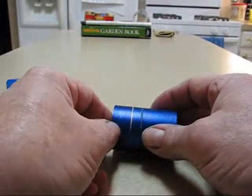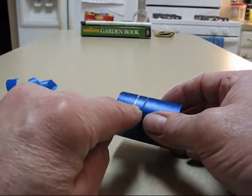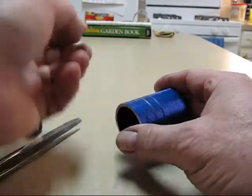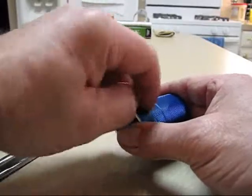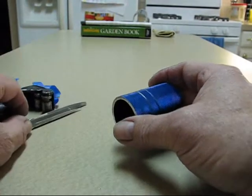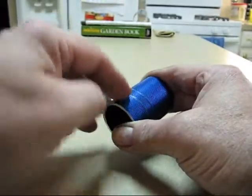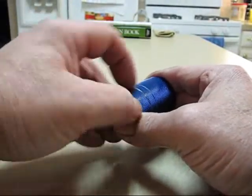You can hopefully see that we've got a nice ring cut in there. Then I'll take some 600 or 800 grit sandpaper, fold it over, and just take it and rub it in the channel to smooth it off a little bit. I'll also take some four-aught steel wool and put a little on my finger and just rub it in that channel to smooth it down. You just want to get in the channel — you don't want to do it on the surface very much, just very lightly.